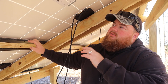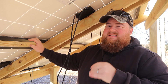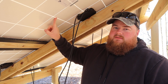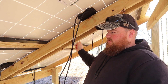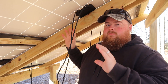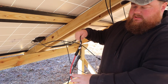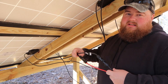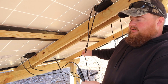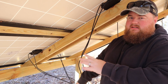Right now we have four panels, and the way the Blue Yeti handles voltage, I'm able to run these four in series. Each panel has a positive and negative — you hook the positive to the negative, positive to the negative, positive to the negative, essentially creating one big loop, turning them into one giant solar panel. What you're left with in the end is one positive and one negative wire coming out. From here it runs into the carport to the Blue Yeti.